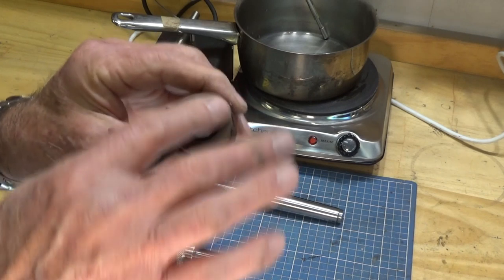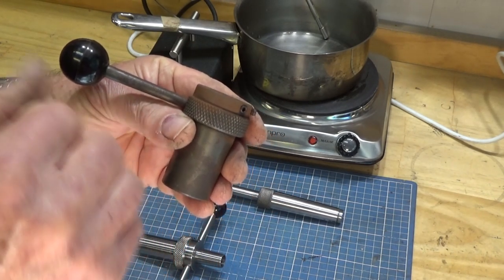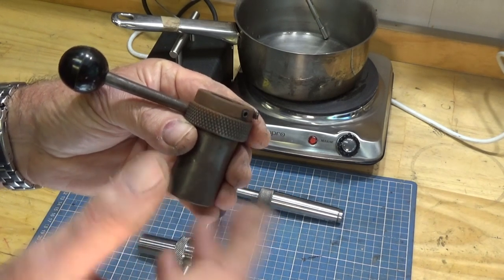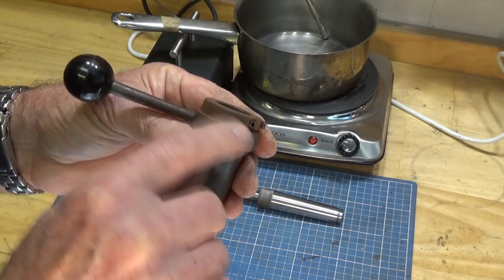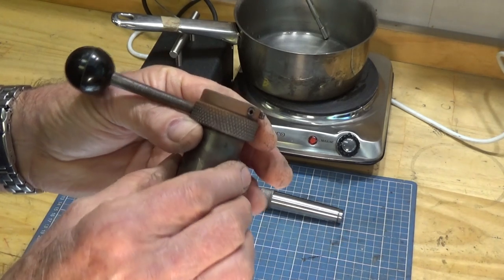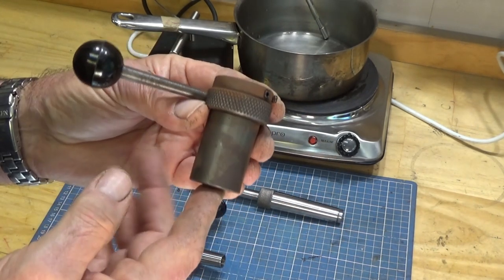Once it gets to this stage where it is corroded, the only way to fix that is to put it into a rust conversion process. You could use Evapo-Rust, which works reasonably well, or you can mechanically clean that with emery cloth or steel wool or a wire wheel. Trouble is that removes the coating that you've already put on it